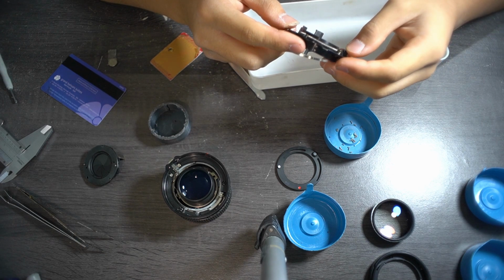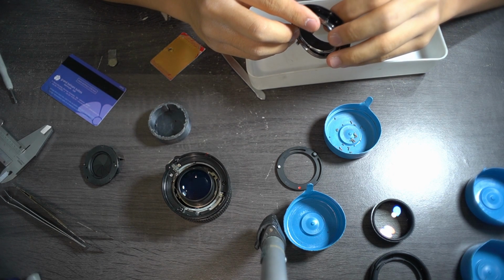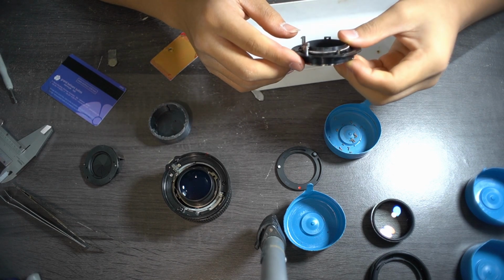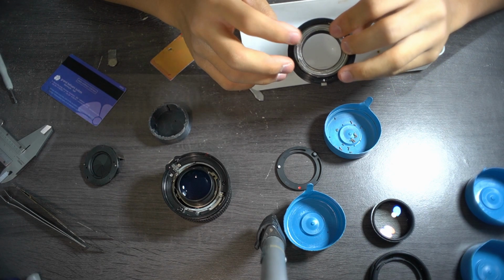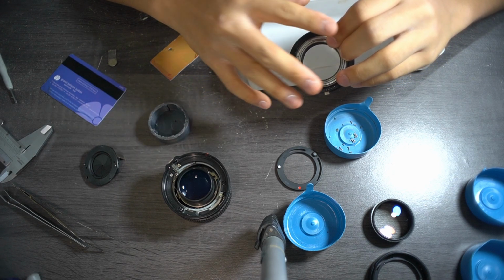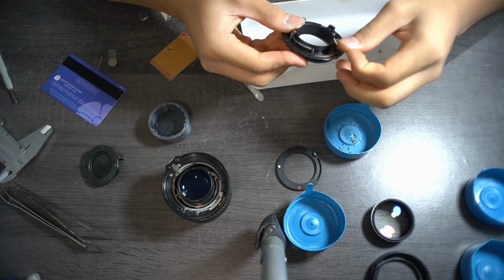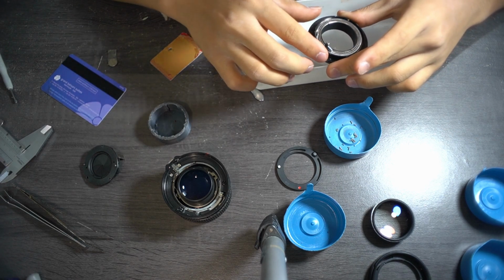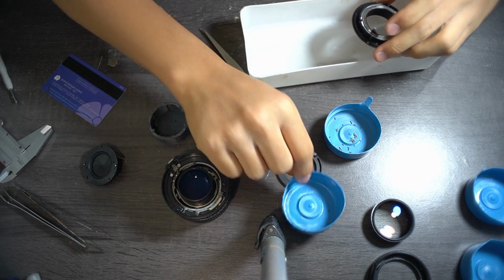An easier way I think would be to decouple the spring first. That'll actually work, man. So decouple the spring, then after I decouple the spring, you have this thing free floating, which means that I can put all the bearings in, and then I can screw it down and then recouple the spring. Let's try that. So it's decouple the spring. Okay, yeah. Now this thing doesn't want to jump up, which means that I can just put the bearings one by one into the thing in here. So let's get this guy.